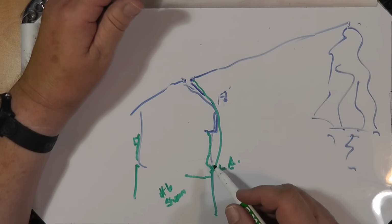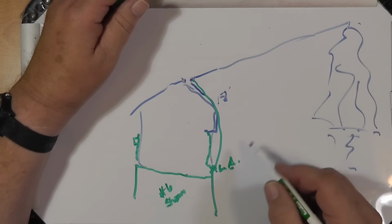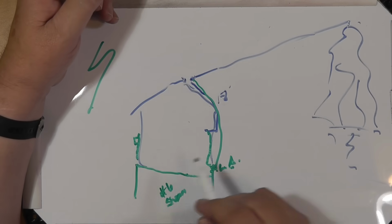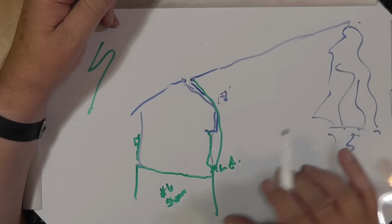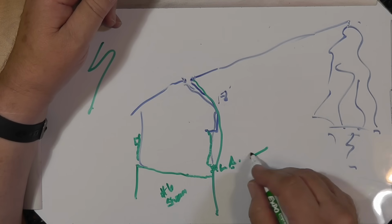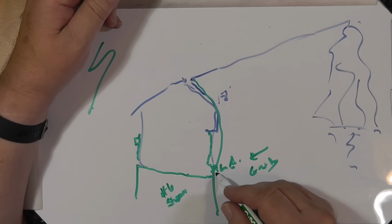Be nice if it were buried. Over to there. That's bonding those two grounds so that if there is a lightning strike nearby, everything is at the same voltage. That's what protects your equipment, okay? So you need the grounding and so on in here.